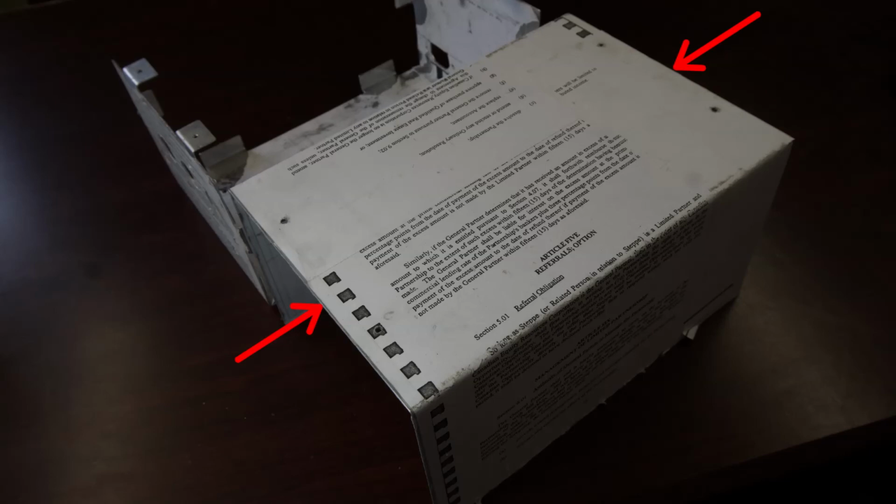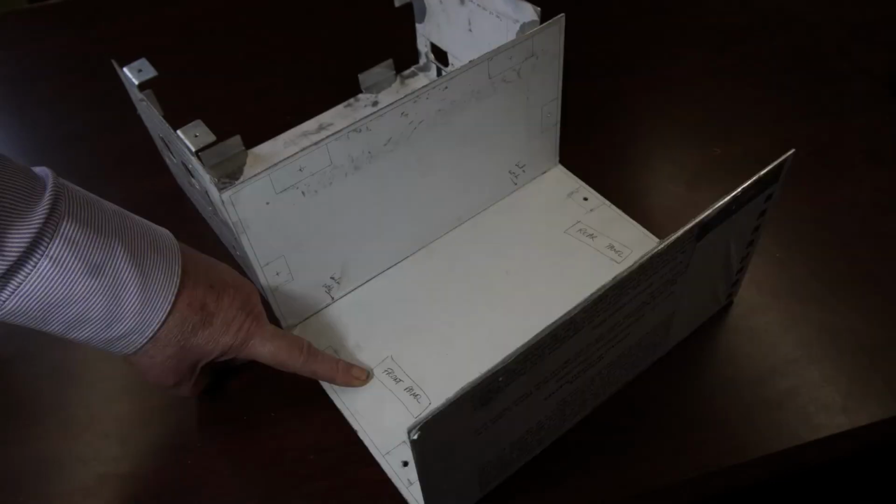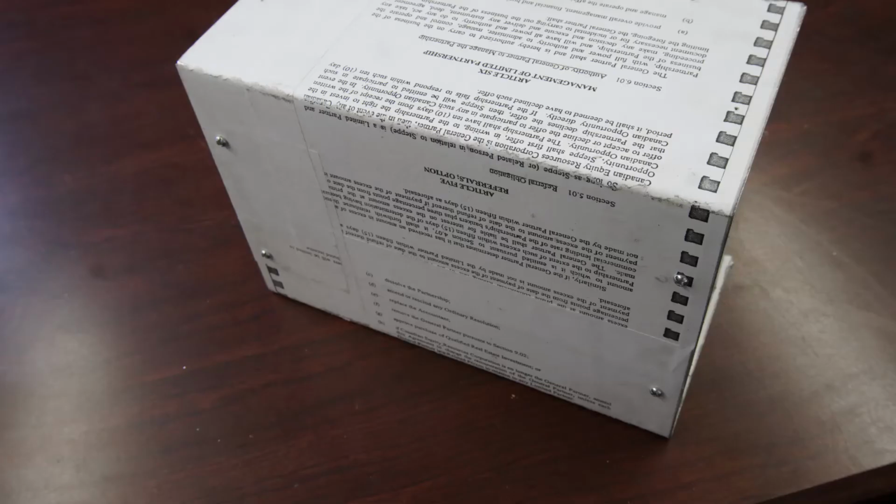On the pattern, the 2 ends are identical, but we're now custom fitting the attachment screws, so there's going to be a very small difference between the ends. Avoid aggravation by turning the cover over and writing down which is the front end and which is the rear end. That will ensure that the cover is always replaced in the correct orientation so that the holes are perfectly aligned. Once the cover has been reattached with 4 machine screws on top, we can work on the sides.